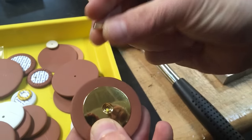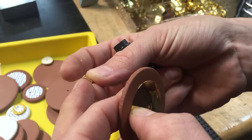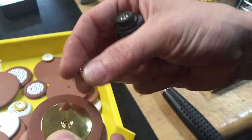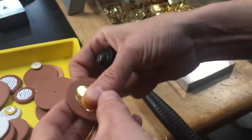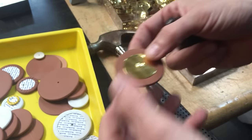These rivets are solid brass and then plated. We make our rivets out of solid brass instead of two parts, like a lot of rivets, because sometimes the two-part ones have a separate head that can rattle in the instrument. That's a real hassle trying to find which rivet is rattling, so we make them out of one part. Also, these are made out of brass so they won't rust.